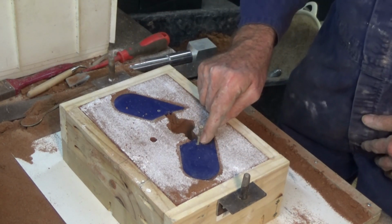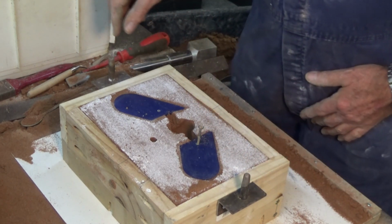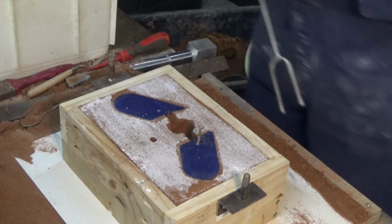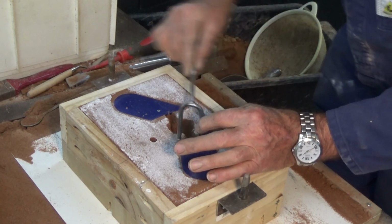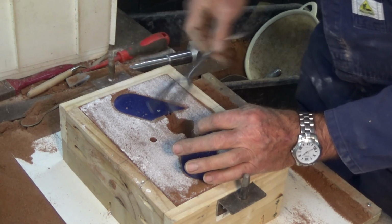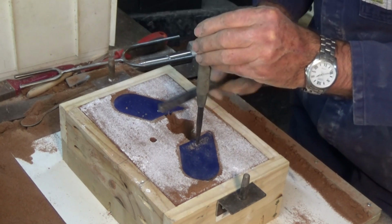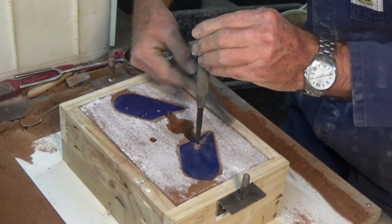Now, unfortunately, I didn't print in any holes when I made these patterns, these 3D printed patterns. And that means that the screws aren't biting terribly well into that material. Got plenty of draft on there, so let's hope we can get them out. Yeah, that thing's a bit light. All right, let's try this method instead. That's better. I can actually hear that coming loose.